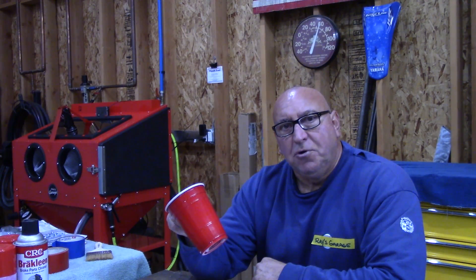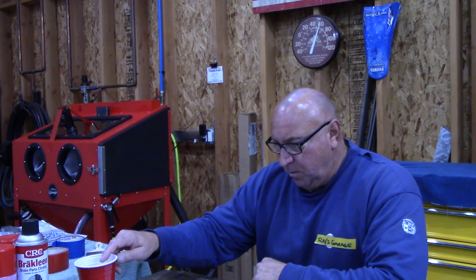I'll be blasting with number 75 crushed glass abrasive. Crushed glass abrasive is about a 4.5 on the hardness scale, diamond being the hardest out of 10. I'll be blasting with about 2 solo cups worth of media. My metering valve will be set full lean, which is full open, which uses less media. Full closed is full rich, and that uses the most amount of media.